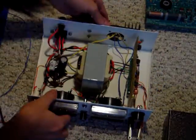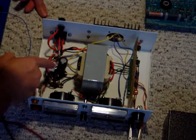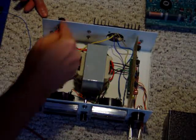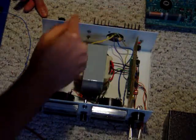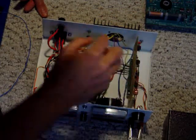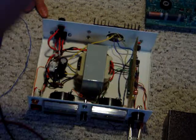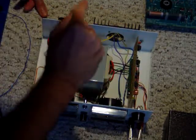Back here is the high power transistor. And here's the bridge circuit, which takes the 120 volt, 60 hertz signal and starts to rectify it — taking the sine wave, taking the negative portion and inverting it so that you end up with a ripple. It's a signal that's not direct; it essentially ripples.